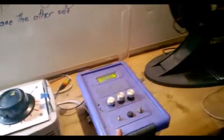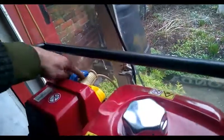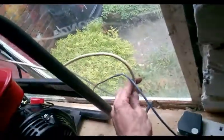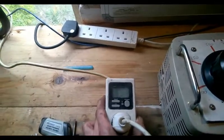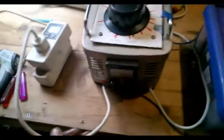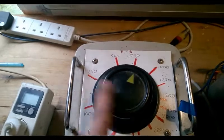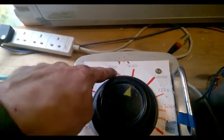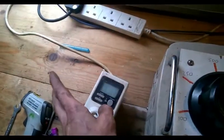This is a vacuum gauge and its cable feeds up underneath the generator and around the back - that blue wire comes around to our control box. We're taking power off the back of the generator, and it feeds into a power meter where we can record the voltage, current, wattages, frequencies and everything to do with the power coming off the engine. That's then fed into this Variac, which has been pre-calibrated on mains for the load that's underneath the desk. This gives us our applied load as if it was mains, a rough indication of what we should be getting, and then we check back onto the power meter to see what's actually coming out.